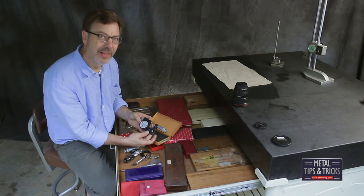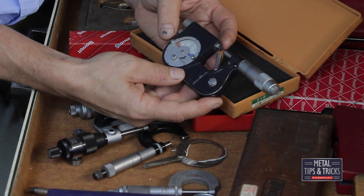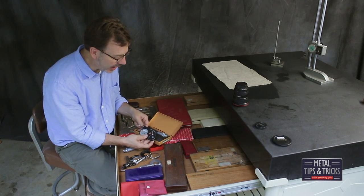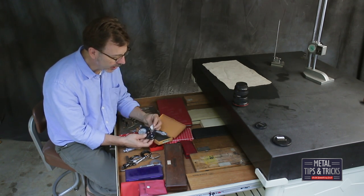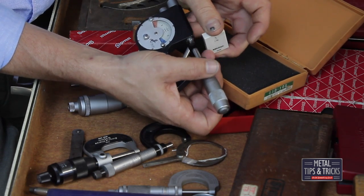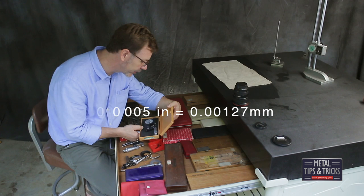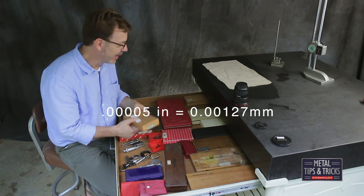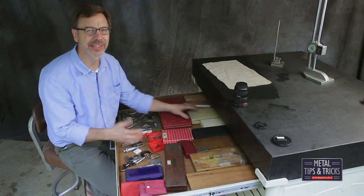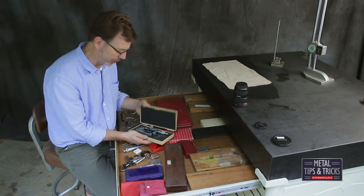This thing is cool. This is a one-inch micrometer set up really for testing tolerances. I can test the tolerances of what I'm working on, and I'll have to do a whole video on this someday. You can measure with it, get it set to zero, and then put other parts in there to see if they're within the tolerances you need. This is accurate to .00005 of an inch — very accurate. I've never really had a situation to use it because I don't do a lot of manufacturing with close tolerances on multiple parts.